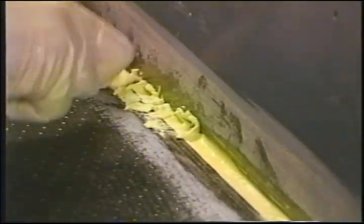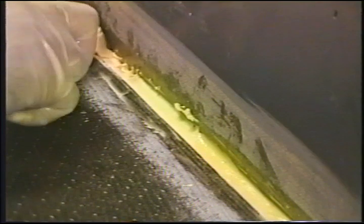Well, there's the micro. That's the first bit I've put in. That's a little on the wet side, so I've gone to a drier mix. And I'll show you how it goes in here. You can see the resin's brushed in there real well. Put in a little bit at a time so that you fill all the holes and small areas. Not one big pile, because you will capture air underneath it if you do.